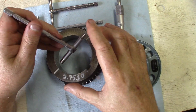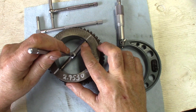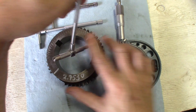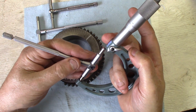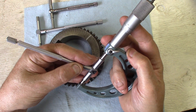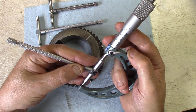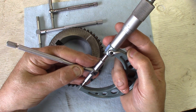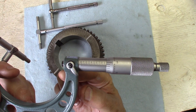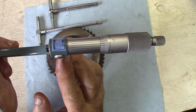Let's see if that repeats again. When you get this discrepancy between readings, it's time to do multiple measurements and compare. Same procedure again - rock forward, wiggle out a little bit and measure again. This one I can tell you, it gives me a different feel from the other ones - and I'll show you why right after. It's 953 again, and this time it gives me 3 tenths. We're repeating within 1 tenth of a thousandth.